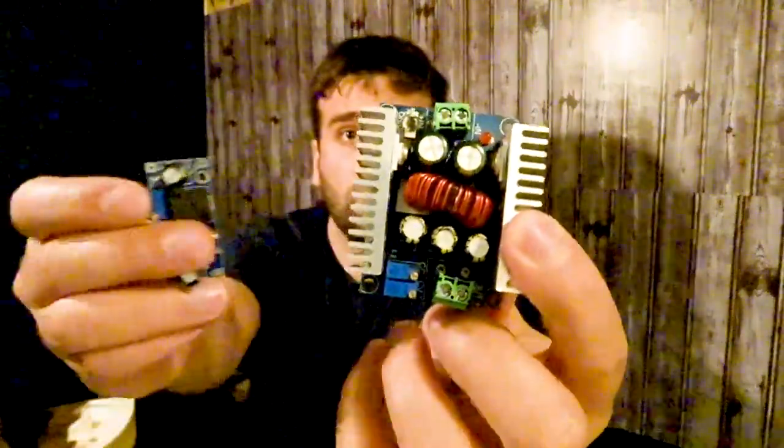After the LM2596, I decided to go big or go home — and I mean that literally. I got a constant current, constant voltage buck converter that is a monster compared to the other buck converters I have. The input voltage goes from 1.5 all the way up to 40 volts, the output voltage is 1.2 all the way up to 36 volts, and this thing can produce 20 amps. It has two pots — one for constant current and one for constant voltage — so you can control that output from 1 to 20 amps, which is great.